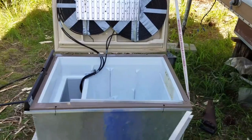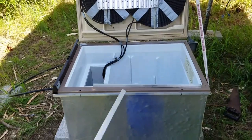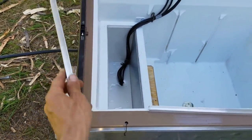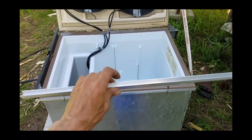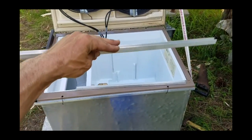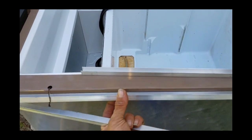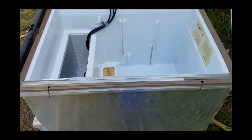What we're going to do today is finalize and finish our alternative refrigeration system. I just got done showing you the coils and how well that worked. Right now I'm installing some aluminum C-channel or U-channel across all the edges. I'm going to go down on the sides on both sides and across the back. What this is going to do is hold the cotton material inside the channel with the water coming out of the outputs from our coils. That water comes into the channel, it's going to wick out into the cloth and run down with gravity, giving us our evaporative cooling effect.